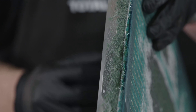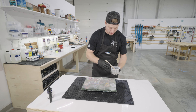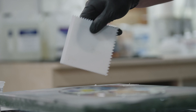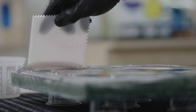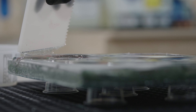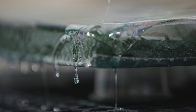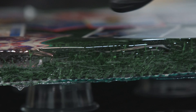When we do a tabletop flood coat — we have our mixed resin here — I'll pour it into the center of the area and use a notch trowel. You can use any type of spreader, a flat stick, or even your hands. Work it right up to the edge and let it flow over and curl underneath the bottom to drip — that's why we have cups underneath so you have a lifted surface. Get a full coverage on the sides, and for little gaps you can use your trowel or your fingers.